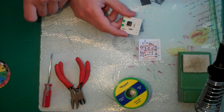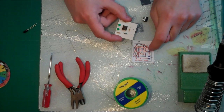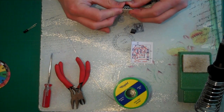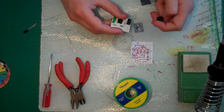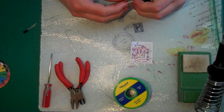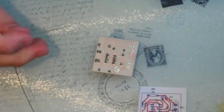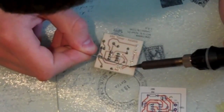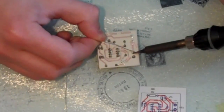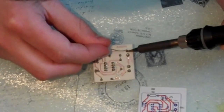The next thing is going to be the terminal blocks. These are just little blocks which allow you to connect things like the switch — that's TB1 — and there's a plus and a minus on the other one which indicates the battery or power supply. We just push these in — I usually put them with the holes facing outwards on the edge of the circuit, though that depends on your circuit as to how you want to connect them. They're a little tight because they have slightly thicker legs than the other components. Then we solder them as before — these ones might take a little longer because they have a bigger area for the heat to dissipate.